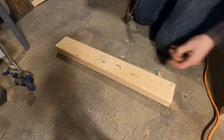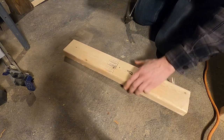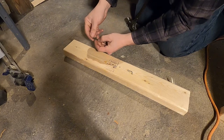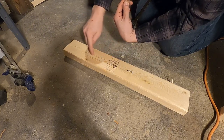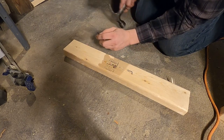The great thing about hand cut nails is they are awesome for attaching wood to concrete, as I'll show you. And a little tip: make sure when you install these, you install the taper with the grain of the wood, and that'll help with not splitting the wood even further.